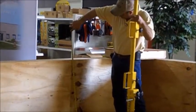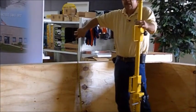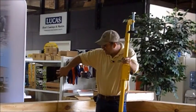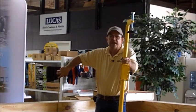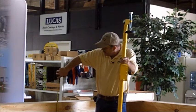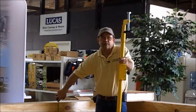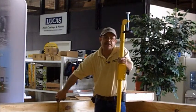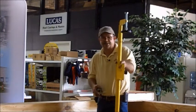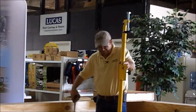On this particular parapet wall it's measuring 33 inches. We can exceed the 42-inch height when mounted to a parapet wall as long as there is no more than a 21-inch gap anywhere. We'll mount it and set the bottom rail at approximately 42 inches, plus or minus three, for OSHA compliancy, and then the top rail we will just float it in a few inches above that.